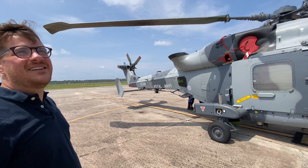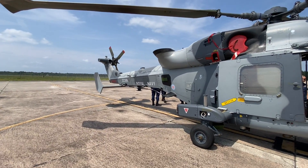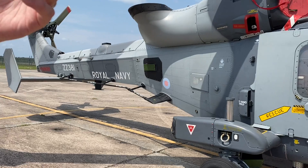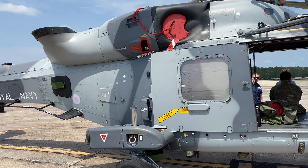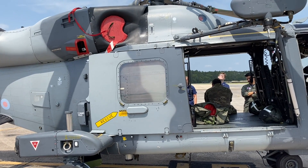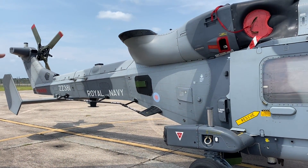I know that on the 60s the blades are similar too — they curve down at the ends, and I think that's for noise reduction. The tail is very boxy looking, and there's an HF antenna on the side. It's boxy because they have the side-mounted HMG — the 50 cal — which introduces a lot of flex into the airframe when you're firing sideways. When you're flying along you get a lot of sideways movement in the airframe.